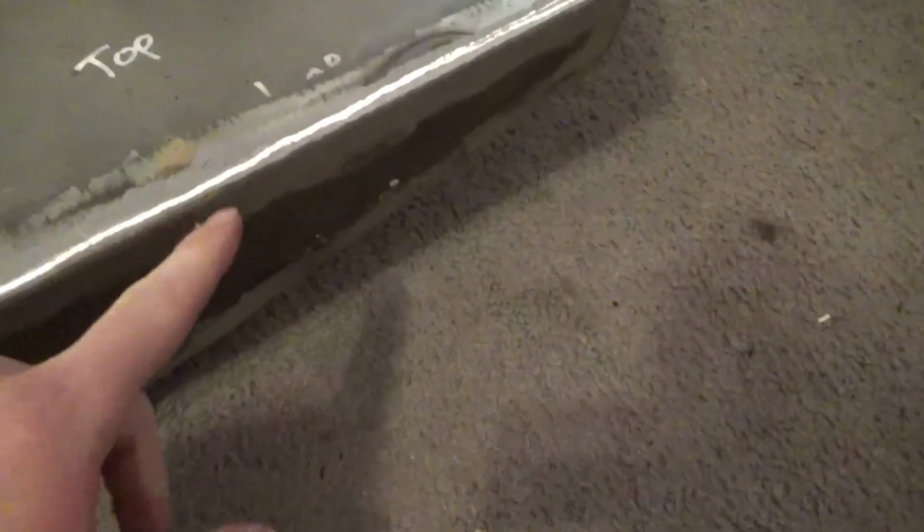It helps being thicker metal, where even if you have a little undercut or something, you could blend that edge off and still have plenty of thickness. So that definitely helped out. A few areas that I don't really like how they turned out. This right here on the bottom, that's not welded yet. That ended up being flush the way I fit it up, which I don't really like for the purpose of welding. I might end up grooving that out and sinking a weld in there, but it might not matter because I can weld on the back side. It's a nice thick fillet weld there.